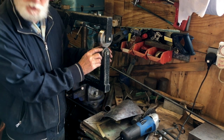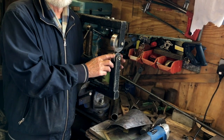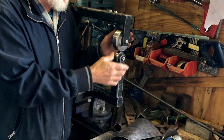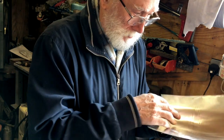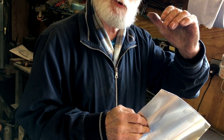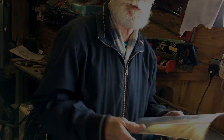It's got a very small footprint, and I used a self-aligning bearing. So you've made all that yourself? Yeah, and threw the outside bit away and just kept the inner, and then put an ordinary one at the top. Yeah. All it does is the flat wheel puts the pressure, the other one makes a groove which actually stretches the material, and you gradually work a bigger area. That's the secret, isn't it? It's stretching. Yeah.